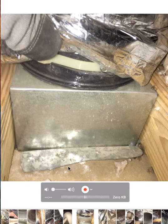This is improper strapping — look at this. It's like a 90-degree turn and it's up and down. That's terrible for airflow. This is a register that hasn't been properly sealed to the sheetrock. And again, this hasn't been sealed, so there's air loss potential right here as well.